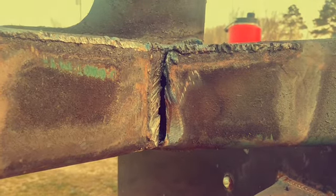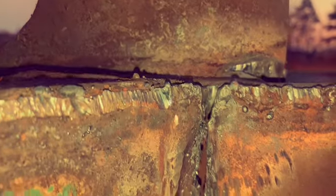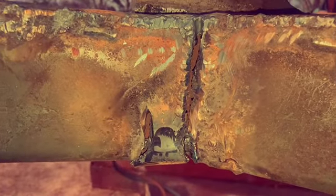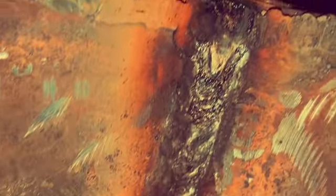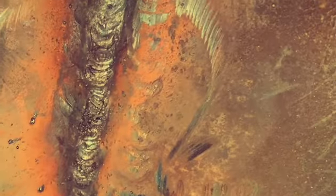So it folded in there pretty good. I need to cut a little bit more relief so we can get it to close in. Did that. Now we have this ugly, look like an alligator chewed it up. But we're going to cram some 60-10 in that crack. Weld that out. Should be good. Did it here. Wide gap, but it did pretty good.